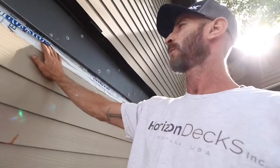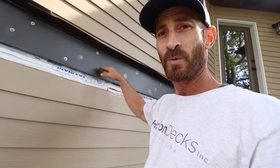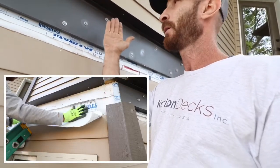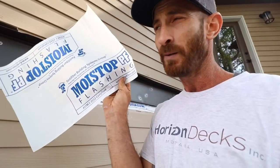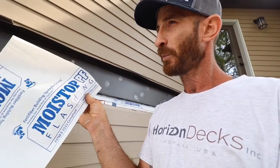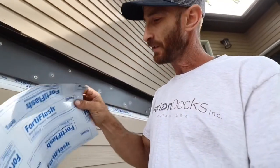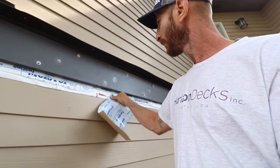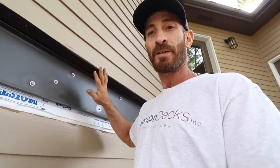We started installing our ledger. The ledger area is critical as far as waterproofing, especially when there is a livable space below the deck line. We cut the existing waterproof membrane, which is this Tyvek paper, so that we can slide new paper behind it to get the correct overlap for the fasteners into our ledger. The first layer we use is a polypropylene or polyethylene — it's the Moistop brand right here. The second layer is a self-sealing, rubberized asphalt, self-adhesive material. We use both of those behind the existing waterproofing to guarantee a good waterproof connection.